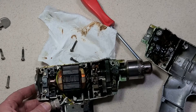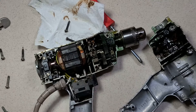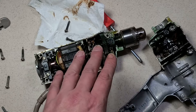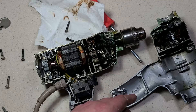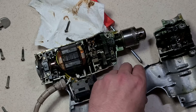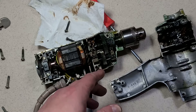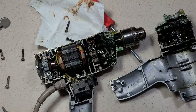That's my video about this old Montgomery Ward Powercraft home utility grade drill. It basically competes with Black & Deckers, and I think it was actually kind of elegant — decent industrial design. Unlike the home utility grade Black & Deckers, it did have helical cut first stage gears, a slightly more compact housing, and maybe a slightly better chuck. The ergonomics are really good; the Black & Deckers of the 50s, 60s, and 70s didn't quite match this drill's ergonomics. Really appreciate everybody watching and subscribing — Caddus Maximus out.